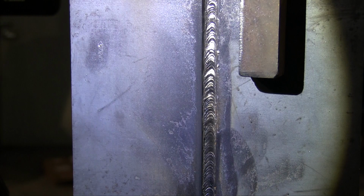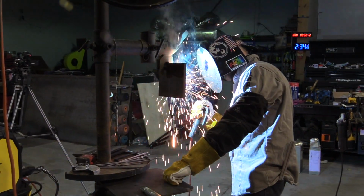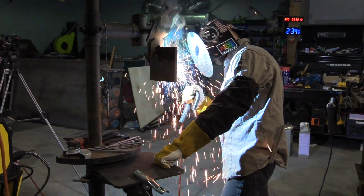Now we're keeping this amperage about 135 here. That could change on a big piece of pipe where you've got a lot more heat sink and everything. This is a 7-inch long piece of plate, gets saturated with heat. So the amperage could vary by as much as 10 amps or so, but it also could vary depending on what machine you're doing. What are you doing here, Andrew?